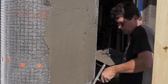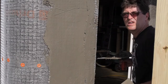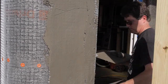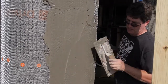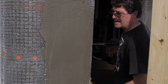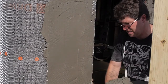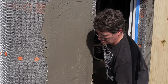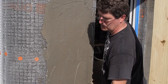I'm not doing my normal production — I don't have my good microphone — because we're just doing this real quick so you can see it. After watching Kirk, here's what we're going to do: we're doing what's called the scratch coat first. It should be about three-eighths of an inch thick over the wire, and then we'll scratch it and let it dry.